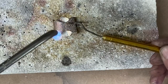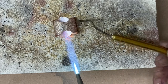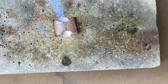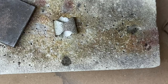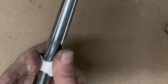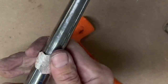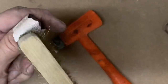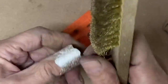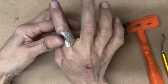We will work our way down from hard solder as we build the ring. Heating the entire ring — when the metal gets red hot the solder will flow. I am going to cool it down momentarily on a steel block, put it into the pickle pot to get it cleaned up, and now it is getting shaped back into its round form on the steel ring mandrel. Make sure you flip it around a couple of times because the ring mandrel is tapered. Let me just clean it up a little with a brass brush.